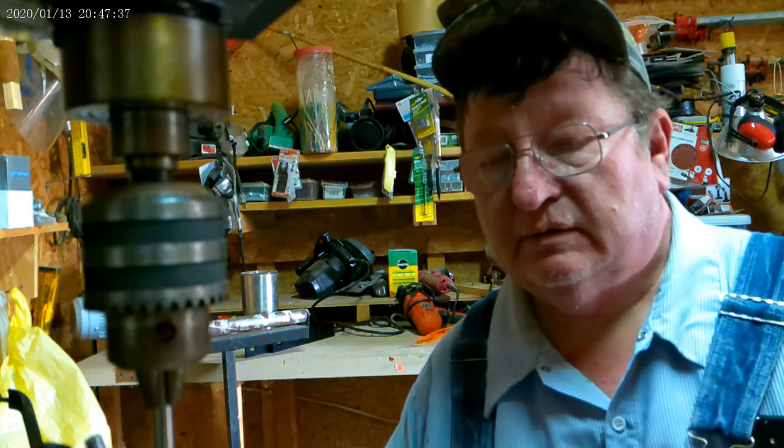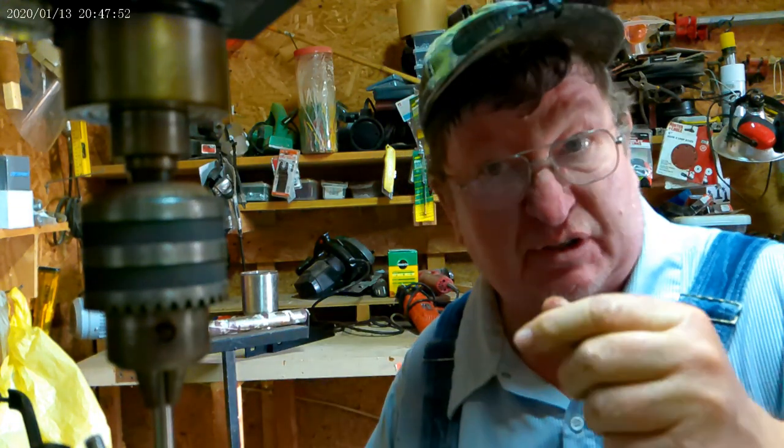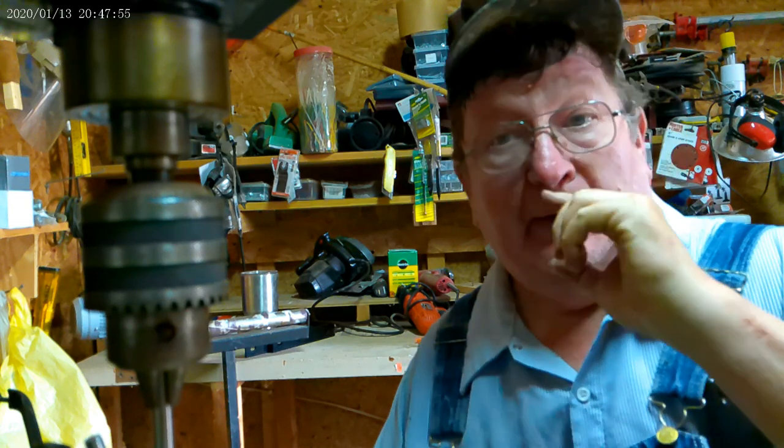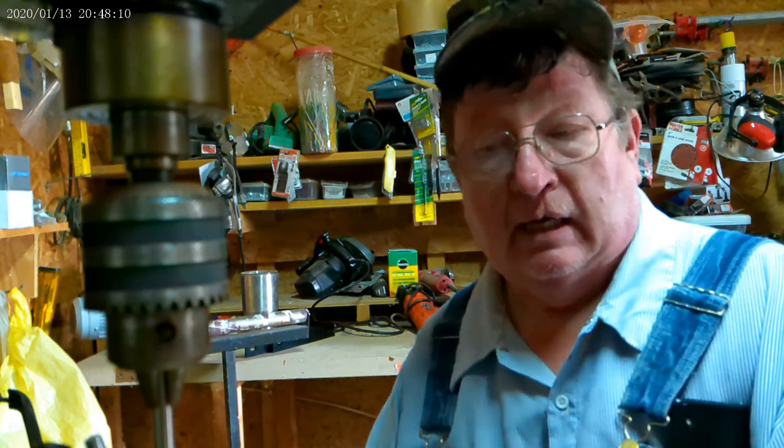Okay, what are my final thoughts? Well, first off, this did good machining the plastic. As long as you set up everything to the side of the table, to the square part of the table, it does good at machining plastic, and it'll do it at right angles and make a 90 degree and that stuff. These rollers, you got to make sure that they're at the end of their play when you start machining, especially metal. The plastic, it didn't make much difference, but the metal made a huge difference. Of course, it's a lot more pressure on it machining the metal.